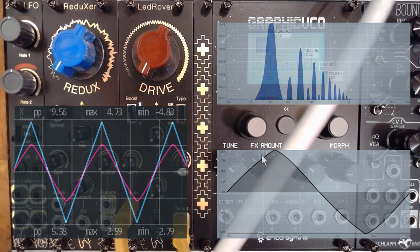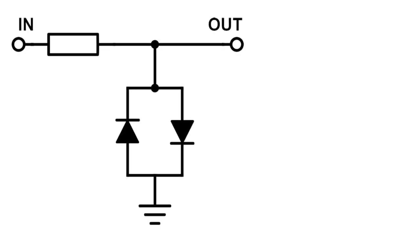If you look at the diagram I have here, you'll see that we have two of those diodes lined up right next to each other. And we can use that, because the nice thing about diodes is that they only allow current coming in from one direction, and it'll only respond if a certain voltage is met. And from there on, it'll start to actually work. In the case of an LED, it will start to emit light.